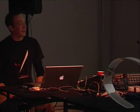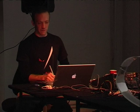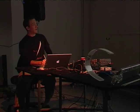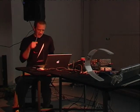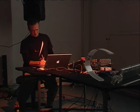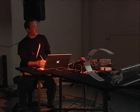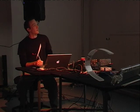So here's the basic technology stack that we're looking at for micro-OSC 1.0. There's a PIC microcontroller. It has a USB transceiver. It implements a serial device class. And on top of that is an Open Sound Control interface. The PIC microcontroller itself has basically these properties: 13 analog inputs, 16 or so digital I/O, the USB, some very pathetic system resources, and some digital communications capability. This is about the same as your computer of 25 or 30 years ago, and they did run Unix on them and stuff like that.